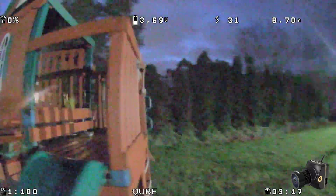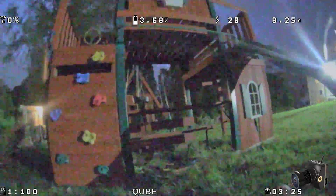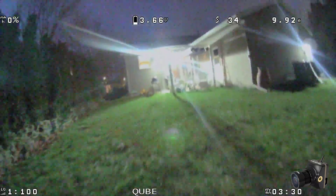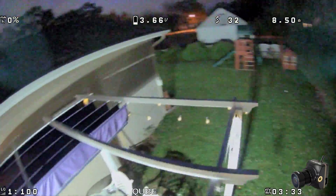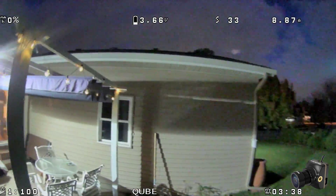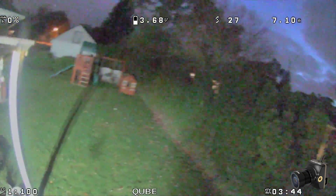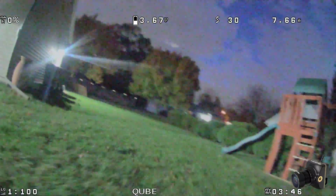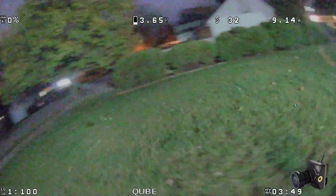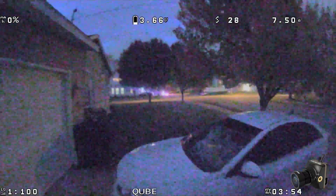The field of view on this lens is 69 degrees. That compares pretty closely to the field of view on the Digisight V2 which I think is 70 degrees. If you want to compare it to the RunCam HD, that one was around 65 degrees. If you compare it to its big brother the Micro HD Zero camera, that one had a nice 75-degree field of view, and we could open that up even bigger to maybe around 82–83 degrees with the RC18G lens, which is still my current favorite for getting maximum vertical field of view.